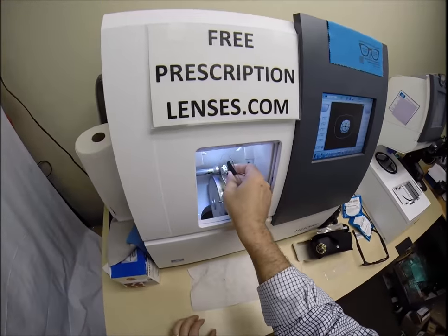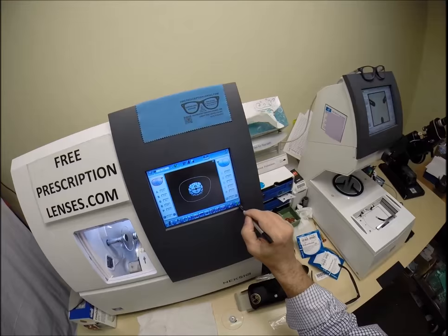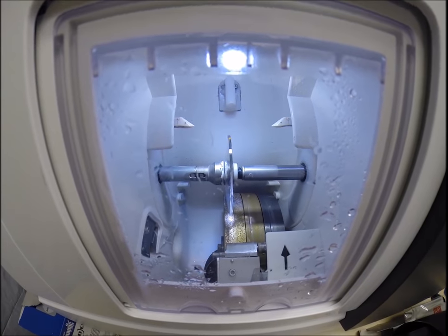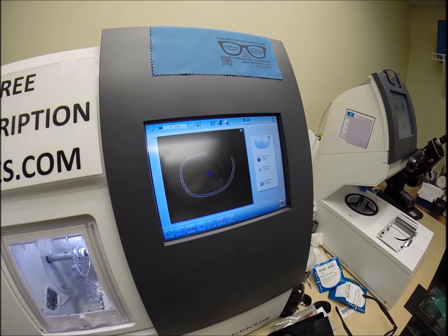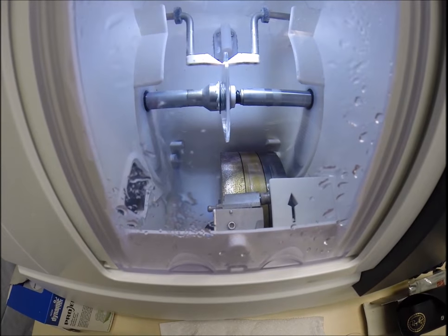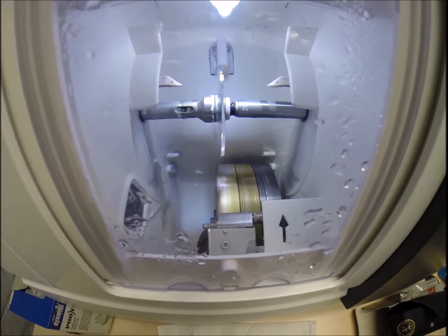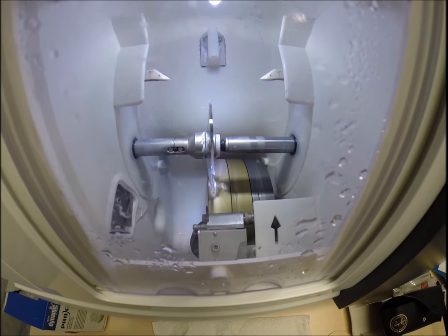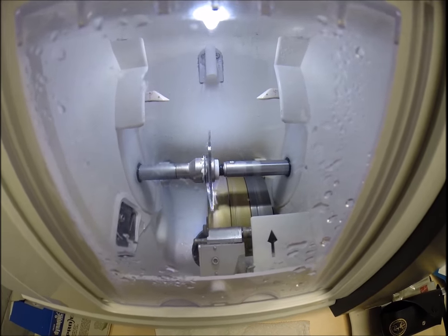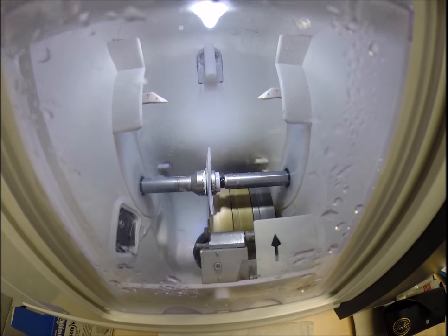Let's put the first lens into the chuck — I like to call it the Chucky baby. I'm going to hit the green arrow, which is start in every language. The door closes, the clamp shuts, and then the lens is traced by two white styli, making sure it's large enough to fit into the frame. Polycarbonate lenses cut dry, whereas plastic, high-index plastic, and trivex cut wet. Water will spray onto the lens for the last 20 seconds of the cutting cycle to wash away the optical debris forming on the edge.